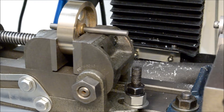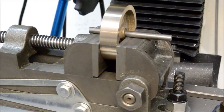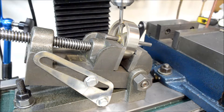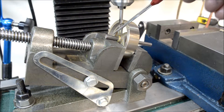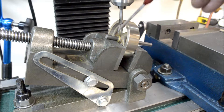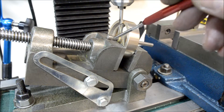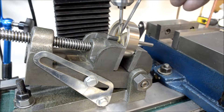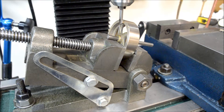Got to get a number thirty-eight drill bit. So we're back. I got the flywheel mounted in the angle vise, centered in the Y direction and locked down. I got it tilted just enough to give me clearance so I can put a little spot here — that'll keep my number thirty-eight drill bit from walking. Then I'll drill it with the number thirty-eight and run a five-forty tap through there. Let's get the show on the road.